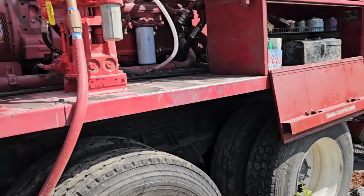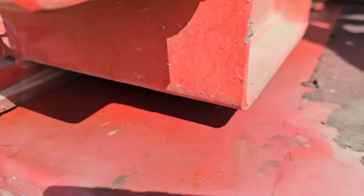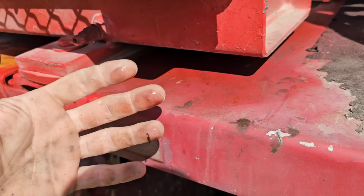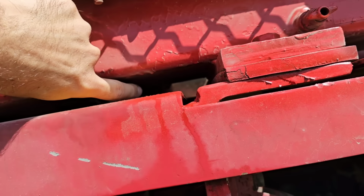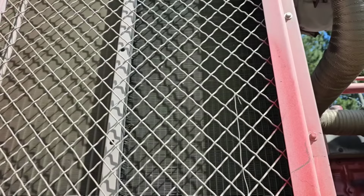So Mike was over there digging. I came over here to unlock the truck and I noticed this wet spot right here. I don't even know if you can tell that on camera, but this is dry and this is wet. And when I look at it, see the color? Antifreeze. Come under here. I don't know if the camera will even focus on that. But basically, underneath here, over there, is your coupler. There's about a 6-inch rubber coupler with two hose clamps on it, and it's leaking. Bottom side of the radiator.